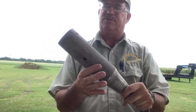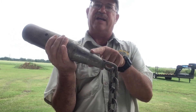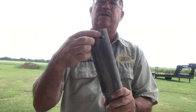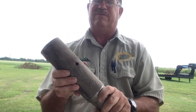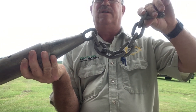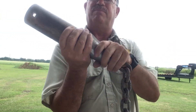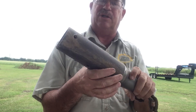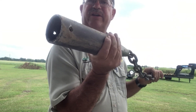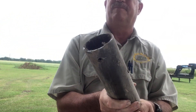He's got about eight inches of two-and-a-half inch pipe. He took a solid shaft, cut it down with a lathe, welded it on, put a chain link on it, welded it all up, and put a couple of holes to run a 7/16 or 3/8 bolt through it. It looks like this is going to work pretty good and will accommodate anywhere from a one-inch up to a two-inch PVC pipe. I'm not sure on the cost yet, but I thought I had to buy three different sizes at about $1,000 for three sizes — this is sure going to be quite a bit less than $1,000.